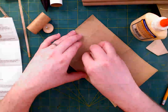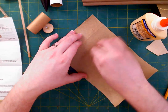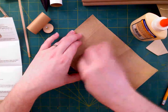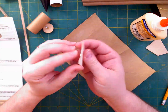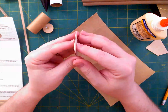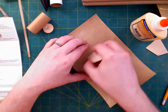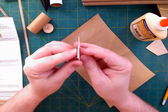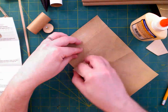So flip it around and do the same thing, and do your best to hold it at approximately the same angle. You need to remove essentially the same amount of material from each side. Otherwise, you will not have a nice even bevel. You will have one that's leaning too far one way or the other. Now, mine, either through some irregularity in the wood or the sandpaper, it's too far on one side and not enough on the other.